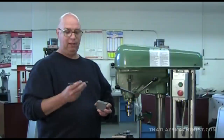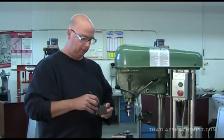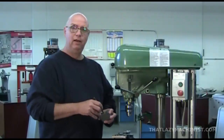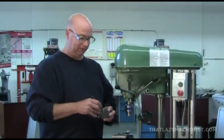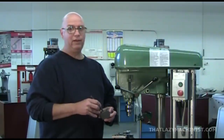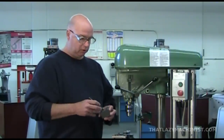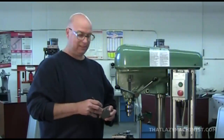First off, we should check if the drill fits snugly in the hole that I've just produced. I see here that I have maybe 5 or 6 thousandths of an inch of play on my drill, which is to be expected. A hand-sharpened drill cannot be accurate within 1/1000th of an inch. The holes that drills produce, it's important to say that they're always a little larger than the drill. If they weren't larger, then the drill would jam in the hole that it's producing. So, 4 or 5 thousandths of an inch here, maybe even a little less, that's quite acceptable.